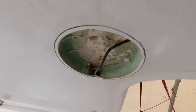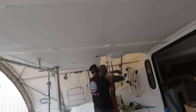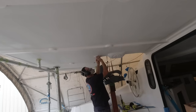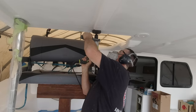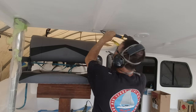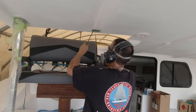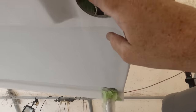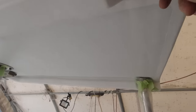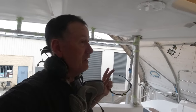The substantial need for accessible wiring in this boat — like any other boat — is essential. I'm installing some access ports in the hardtop here to facilitate firstly the install, and secondly changes and repairs into the future. Luckily I'd planned this out, so I've got a good conduit running all the way to the outside, another one running along to the light, my drawer cord, and one going back through here so I can pull wires all the way through this hardtop.